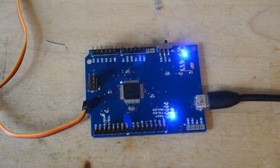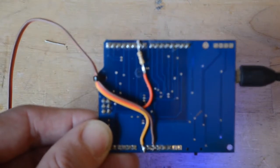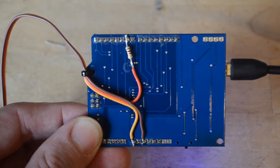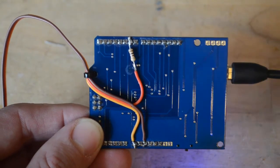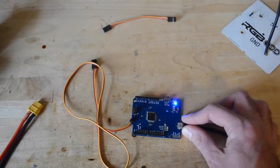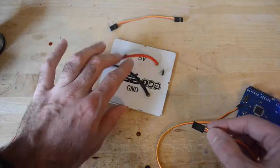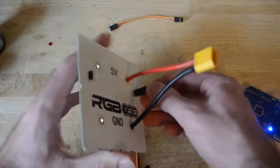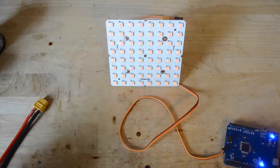Now to test out our boards, I basically have an Arduino clone here. I've added a 100-ohm resistor to the back of this board on the Digital 6 line, and that's compatible with many of the Adafruit examples and also the repository we have on GitHub for control with the Arduino. I've also hooked up ground and power on the back side of this. I'm going to take this input from the Arduino and plug it into the input of the matrix. Typically when I add this, it causes the Arduino to go into bootloader mode because we are powering the matrix directly from the Arduino.